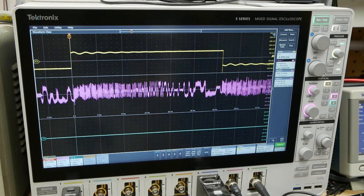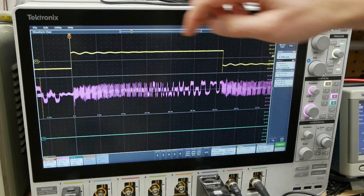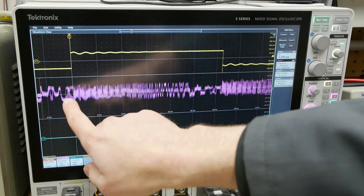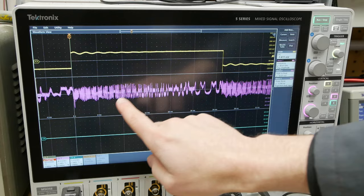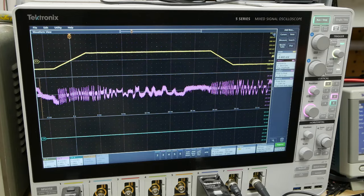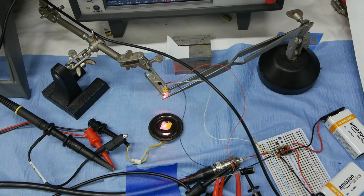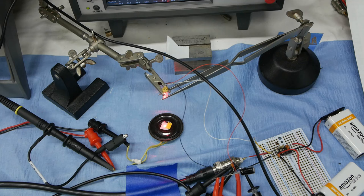With a square wave I can actually hear the speaker now — up until now all the waveforms have not been audible. The sharp snapping voltage is oscillating the speaker membrane, and we can see that with the trace just like we did with the sawtooth waveform. The reason it's audible is because of this response wiggle — we can see it rings for a long time, and it's just about done ringing when it gets snapped again. If I switch to a waveform with a much more gentle slope, I can't hear it anymore because there's less ringing, and it's down to almost no movement. Remember that one interference peak is 650 nanometers, so air currents alone could cause a 650 nanometer shift.